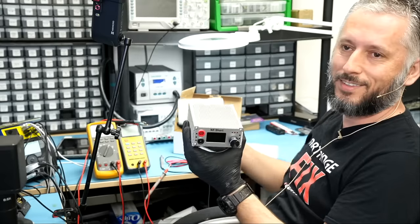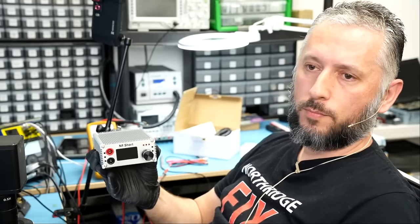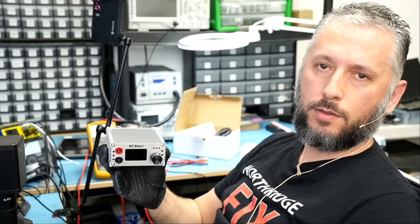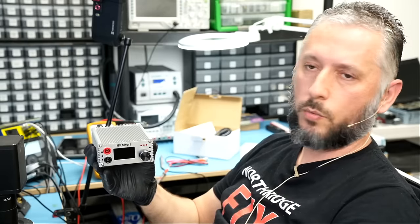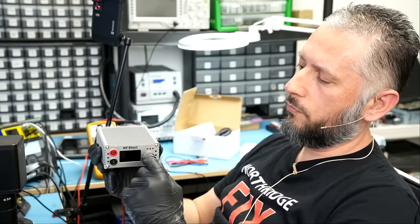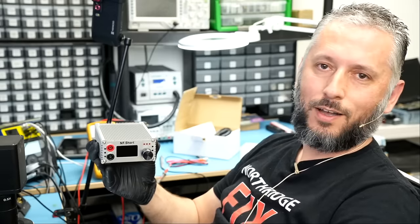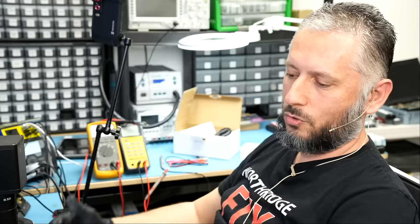and right there. Now, what's special about this tool is you have control over both volts and amps using this one button. Click on the button, and you can set the dials for your voltage. Click on that button again, and you can set your maximum current. For voltage, you can go from 0.6 volts all the way up to 21 volts, and for current, when you click again, you can go from 0.5 amps all the way up to 21 amps, but you never want to inject 20 volts onto a motherboard, onto a GPU, onto a laptop, or any consumer electronics, and you never want to go up to 21 amps.